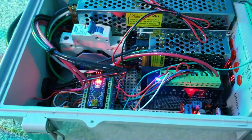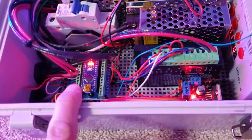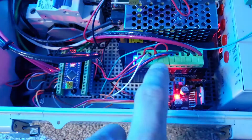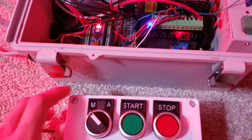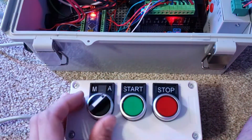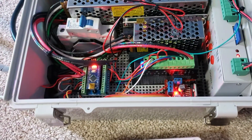All those LEDs run off of a 5 volt 20 amp power supply, and everything else in the box runs off the 12 volt power supply I have here. That includes the Arduino, which is kind of the brains of the ride, and the Arduino talks to two motor drivers — the DC motor driver down here and the stepper motor driver right here. It also has some inputs going to it from this control panel here. I've got an input for maintenance mode, off mode, and automatic mode, and then I've got ride start and ride stop buttons. So not too complex but just enough to be dangerous.